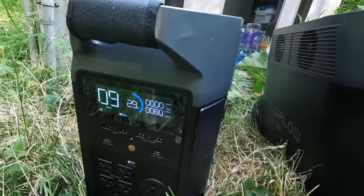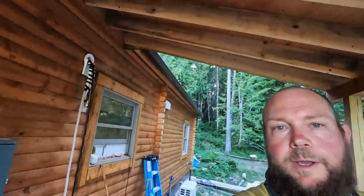Let's check the units and see what's going on — we've got 1,500 watts going on one unit and only 78 watts going on the other unit. I'm going to go up and check out what is running at the house. As I'm coming up to the house I can hear the ERV running, we got our outside lights on, and I peeked inside the trailer — our coffee maker was running, and that probably takes about 1,500 watts just by itself. We've got all of our lights working.